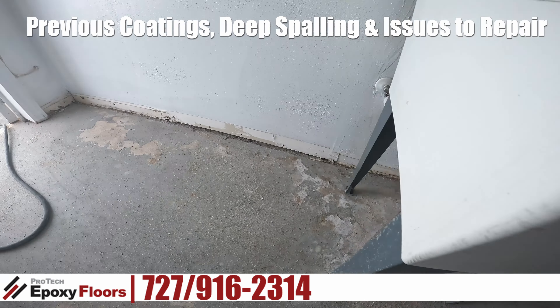Rolling is the final distribution of the epoxy — we get it as flat and even as possible before we actually start to broadcast chips. Now comes the fun part where we begin to feed the chickens. We inundate the epoxy with about three times the final amount needed to ensure full coverage. Before we topcoat the job, we scrape and then recover the chips as well.